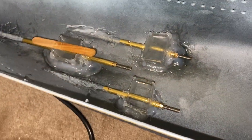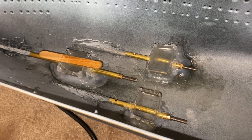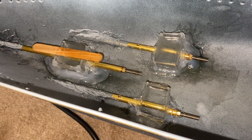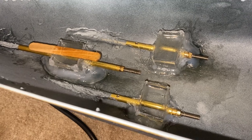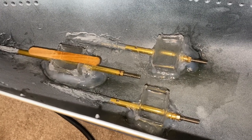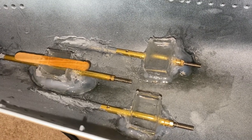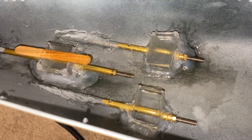Now, I should say, I did foresee this, and I did test out these casting caissons beforehand with water. But of course, it's a difficult thing to work out, because water has so much lower viscosity than the resin that water was running out of these quite quickly. But I estimated that because of the viscosity of the resin, it will probably leak out incredibly slowly.